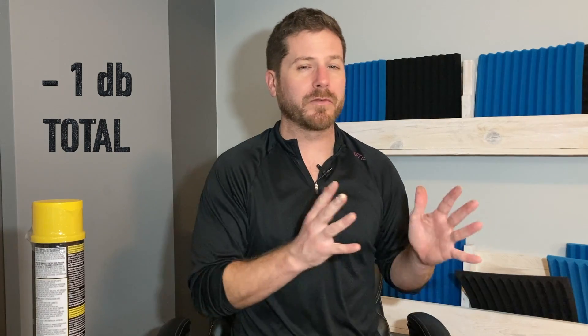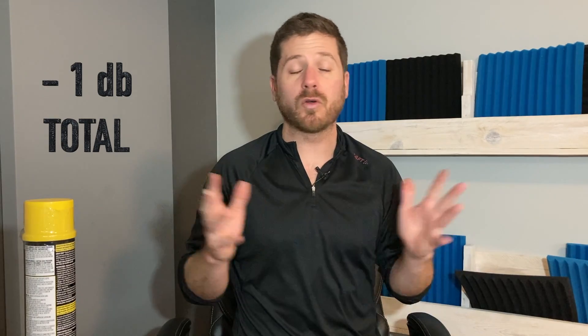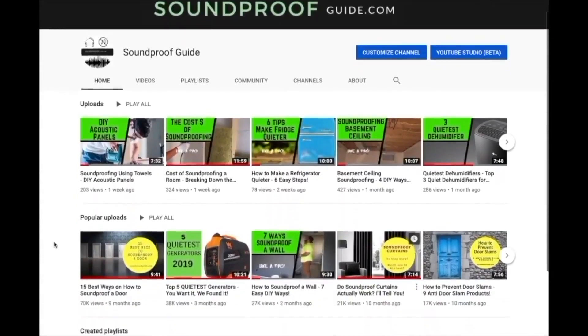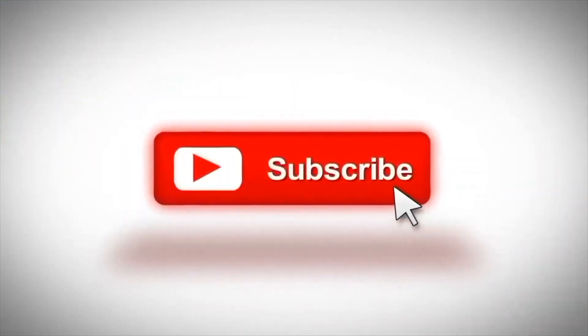So if you're looking to soundproof a door, this really is not the way to do it. It's a little costly, it's a little messy, and really the only things you need to soundproof a door on a budget are a door sweep, some caulking, acoustic caulking around the frame and inside, and a weatherstrip. Check the video right up here to guide you through that process. Thank you very much for watching — subscribe, like, and share this video, and leave a comment. Feel free to check our other YouTube videos and articles on soundproofguide.com.